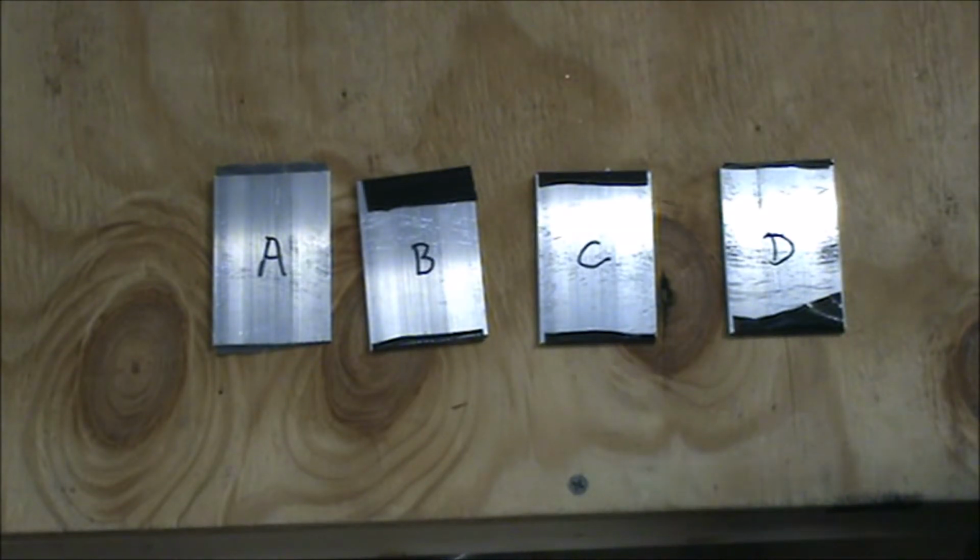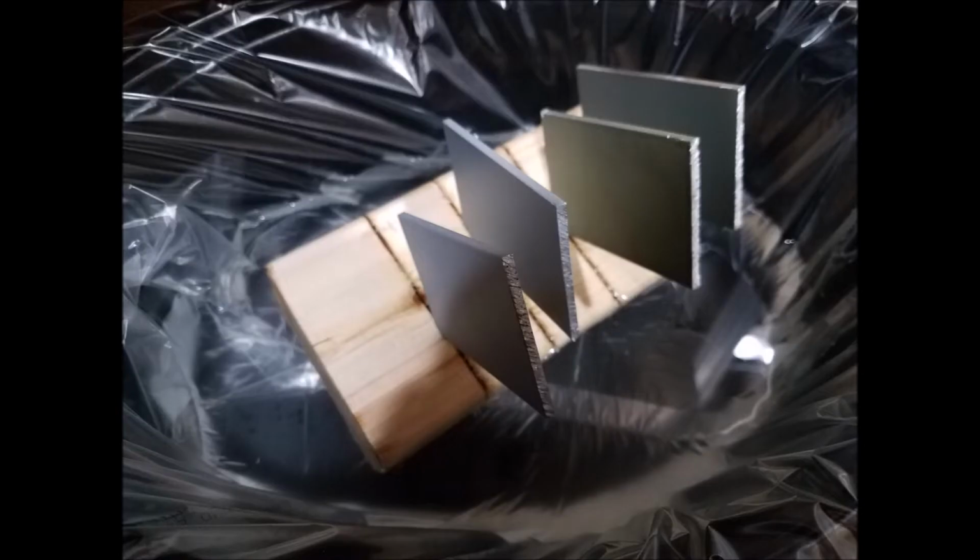The other pieces were the ones that went in the saltwater environment, and basically they were at just above 100 degrees Fahrenheit for a 24-hour period, and now they've been brought out of that salt humid environment. First off, here's a picture of them sitting. Basically I stuck them in a crock pot full of salt water that was 3.5% salt concentration.